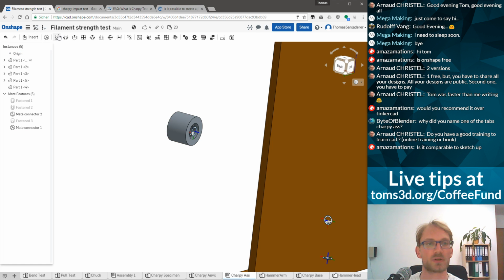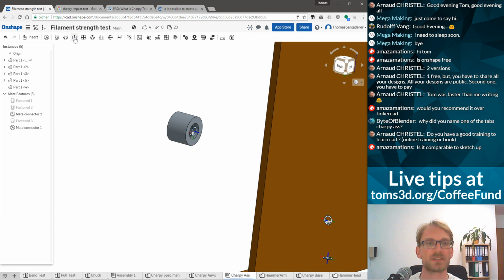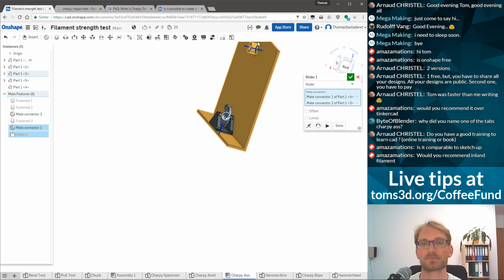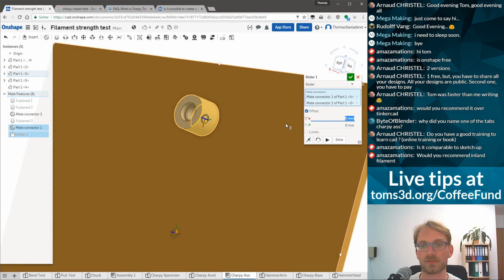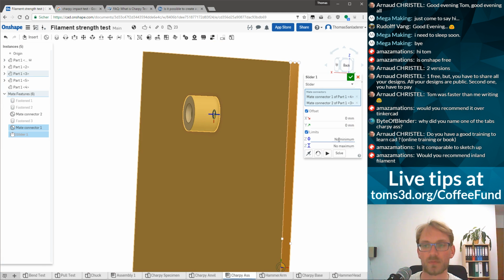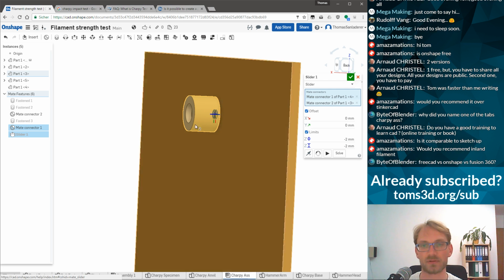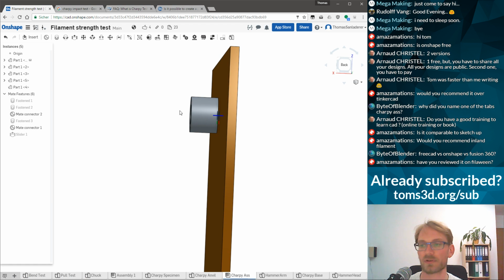and then we're gonna mate up to a, well, actually no, slider mate, because I do want to define the distance somewhere. So if you say offsets, is that going to offset the center point? Let's see, 5. Yeah, that just slides it around. Limits, minimum, if you say minimum 2, max, well, -2, -2, it's going to be stuck in that very position. Perfect.